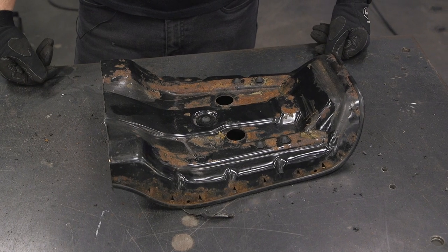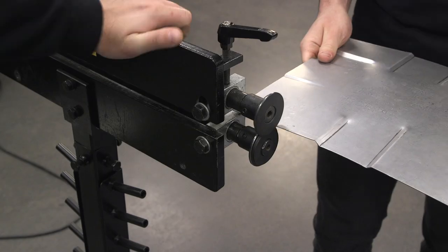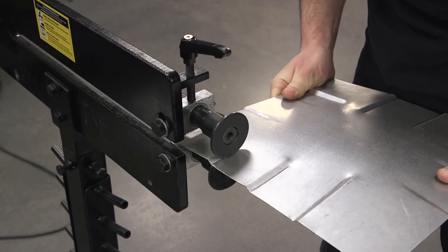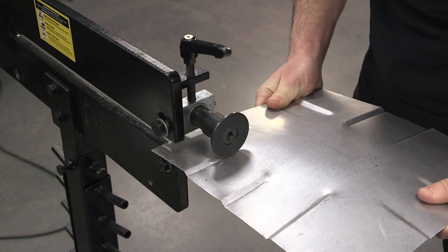To transition from the factory pan to the rear of the seat pan, the factory pan has a stamped shape — down, up, kind of wavy throughout. I figured I might be able to match it with the offset dies in the bead roller. I got a couple of test pieces and just started rolling, trying to match the angle and height of the step down, keeping the highs and lows for each step nice and parallel. After a lot of test runs, I got it dialed in perfectly.